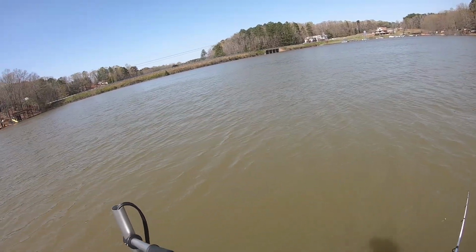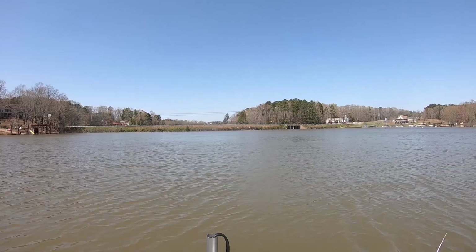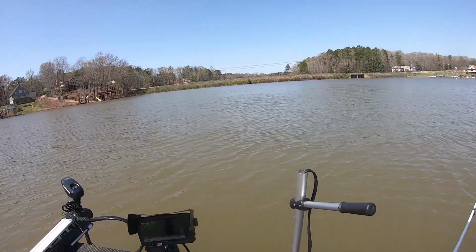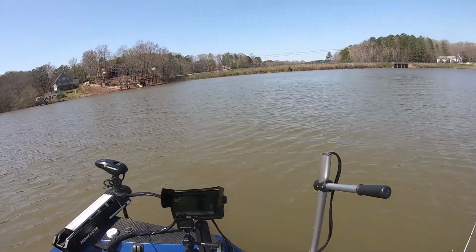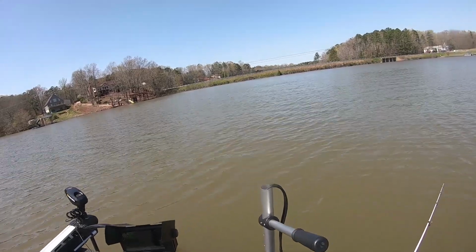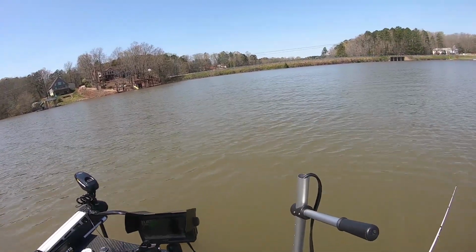So I made some today, and what I done was, when I had a pack already made, I took one of them out there with me and laid it down, mixed my coloring up. I shot one mold, opened it and looked at it. It was a little too light. I darkened it, shot it again. It looked like it matched really good, then I went on. That's the only way I could do it, guys, is keep on trying to match a pattern. I keep one for a pattern of the color, and I just try to match it as close as I can to it. If it's a touch different, it's not gonna make that much difference.